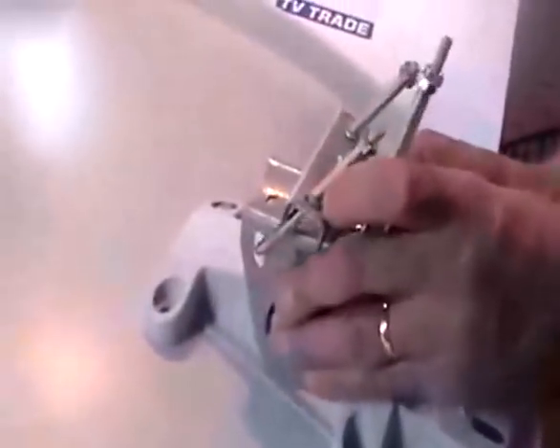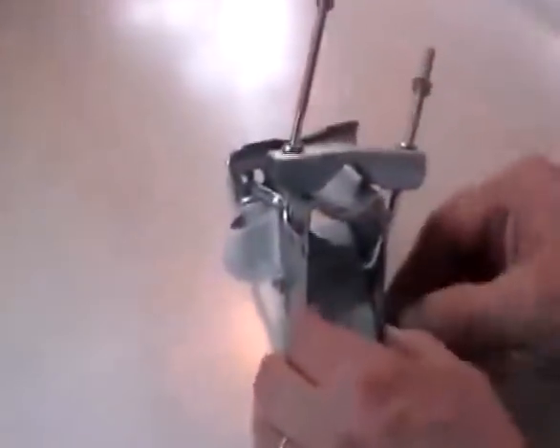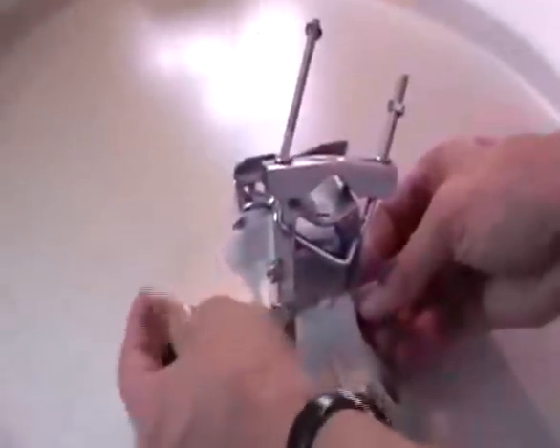The next step is to bolt the elevation bracket onto the dish. We slide it on, and I normally have the arc symbol on the side of the bracket visible on the bottom part of the dish. We slot the bolt through and pick up a nut on the far side, hand tightening it most of the way. I repeat the process for the bottom hole, slot the bolt through, and put it in. At this stage I can pick up the socket, but we don't want to tighten this nut rock solid yet — we need to be able to change the dish elevation until it's aligned, then do a final locking afterwards.